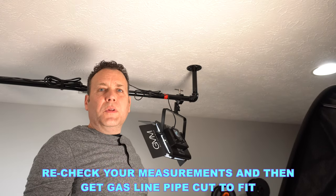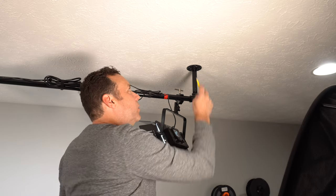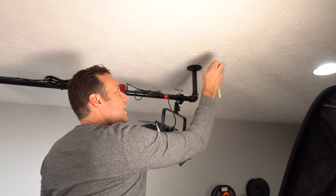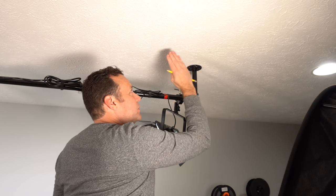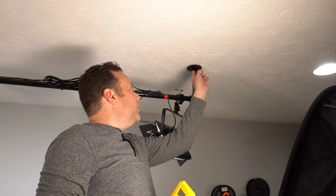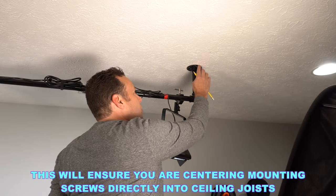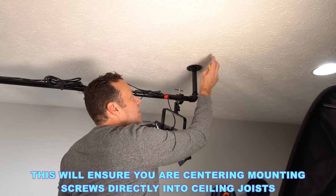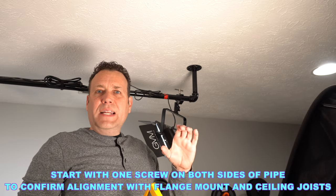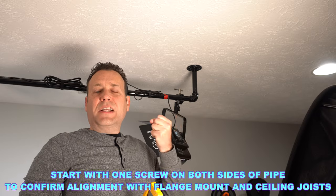I found it very useful at the center point where you're going to be mounting to put a cross or an X — one line this direction and one line this way, creating a T. That way, when you're trying to match up the flange, you'll be able to see through the holes and see that cross, and if you go long enough you'll actually see it coming out on the other side. Then you're going to put in one screw — you want at least a 3.5 to 4-inch screw, heavy duty, like a deck screw.